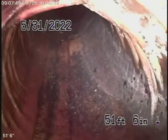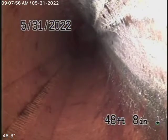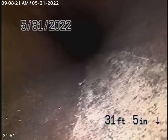As we bring our camera back, you can see we have a cured-in-place pipe lining coming back from the middle of the street towards the property. So far we're looking okay. However, this is not really a legal lining — it's not a 4.5mm lining — but it is functioning and it is working.